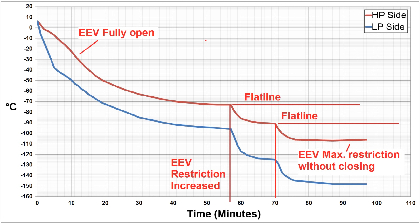I think the gas mixture can be optimized even further to get closer to minus 170 or minus 180°C. At the time of editing this video I actually reached minus 161°C by adding a small percentage of butane into my mixture. By replacing some of my methane with nitrogen or even argon I should be able to push below minus 170°C. All of this progress was made without pre-cooling — with pre-cooling, the gas stream entering the regenerative heat exchanger will be at least minus 25 to minus 30°C, possibly even colder, giving around 50 degrees of drop from room temperature. With that much of a boost, it wouldn't be surprising to see close to minus 190°C unloaded and probably minus 170 to minus 160°C with 15 to 20 watts of thermal loading. If I can hit those numbers, I should be able to produce several liters per day of liquid nitrogen, and then set my sights on liquefying hydrogen by using the liquid nitrogen for pre-cooling. In preparation for that project, I've begun building an electrolysis cell that can produce around 200 liters of gaseous hydrogen per day.